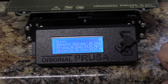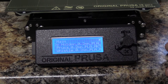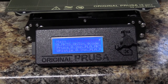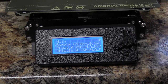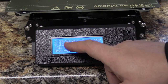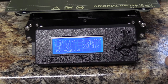This is all the files on the card. Usually with the Prusa printers here, the most recent file is going to be at the top. So the one I just loaded in the previous demo was the TV remote holder, and it's listed right there. It gives some nice information, including telling us that we should be printing on PLA, so we know that we have the correct filament loaded. Once we find the file we want, we just hit the knob on that file. It goes back to the main menu and says we are now preheating to 215 degrees for the hot end and 60 degrees for the bed. It also tells us this should be an eight and a half hour print.